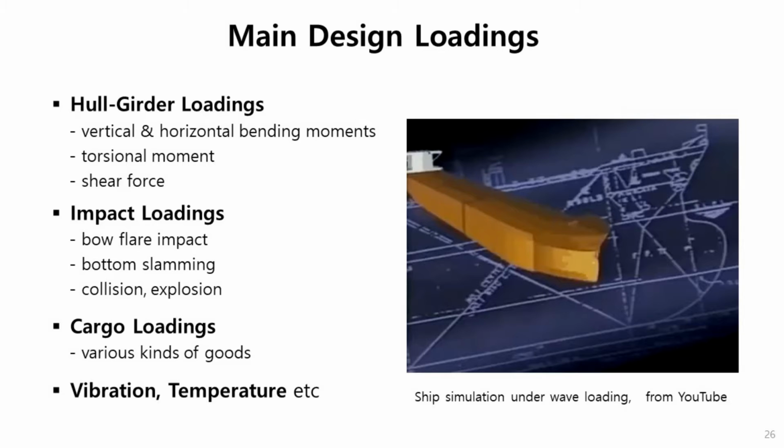The hull may be compared to a simple beam. When a force acts on the beam, it bends and stretches in accordance with the magnitude of the force and the strength of the beam. Loads generate vertical static forces in still water. Waves generate dynamic forces that act vertically, horizontally, and transversely, also creating shear and bending forces, in addition to tension and compression.